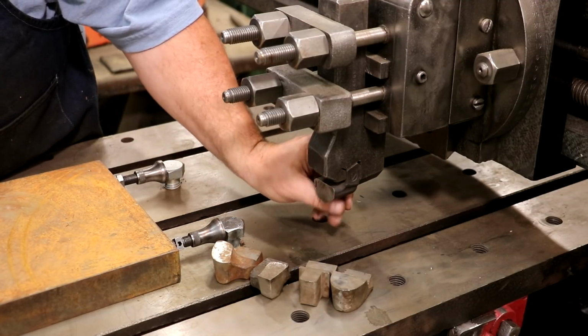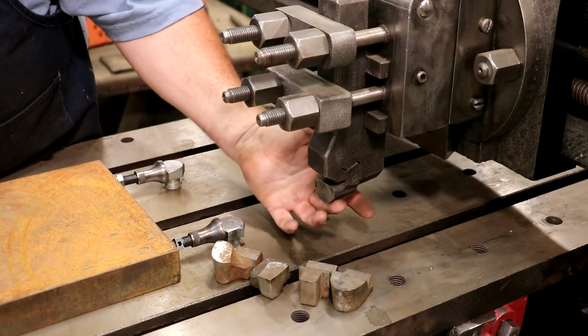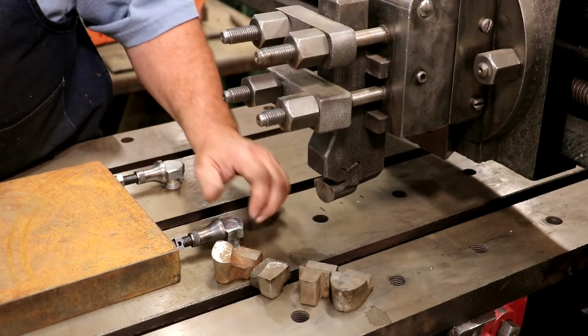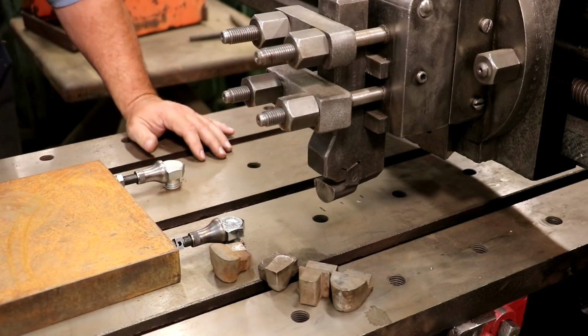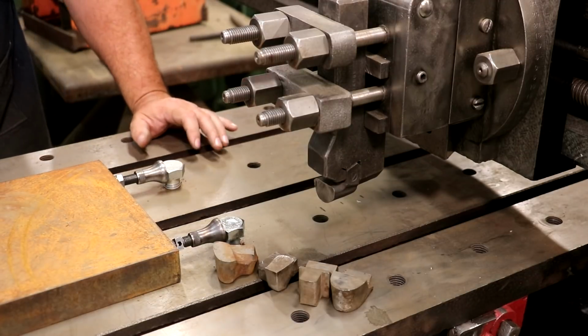You can sharpen these. You can come in and just kiss off the fronts and the surfaces around there. Right now I've got a round one in here. This would be a general purpose one. But there's a whole bunch of these different types of inserts. I just have an example here of some of the ones that you can plop in and out of these tools. Actually, these inserts don't fit this tool. I've got another holder, but you get the idea.